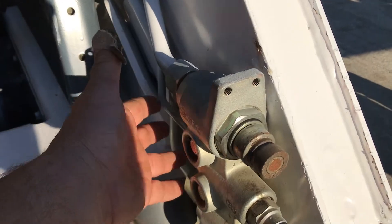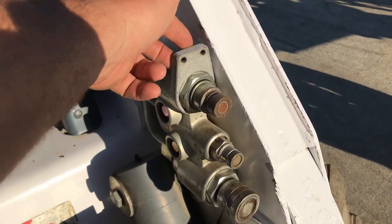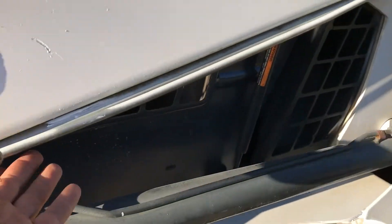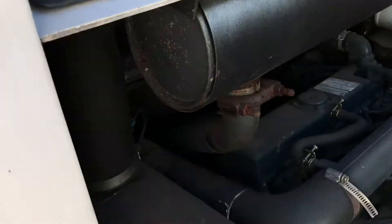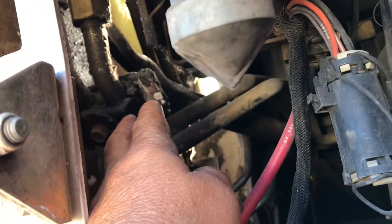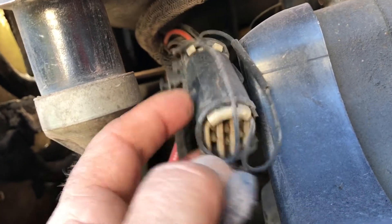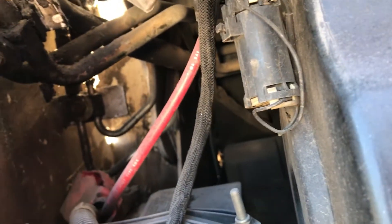If you look at this machine, all of the hose lines run on the external portion of the boom — there's nothing getting fed through — so this is going to go pretty quick. Here's the mount where it's going to go. We follow the hoses along here and tie-wrap to the hoses as we run down the lines. We feed down inside through here, and this is the connection point — the other end where that barrel connector is. We take this little cover off and plug in here, and everything should work.